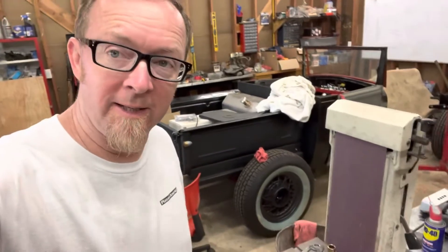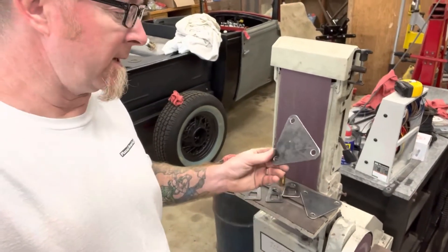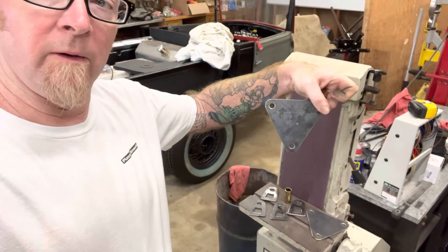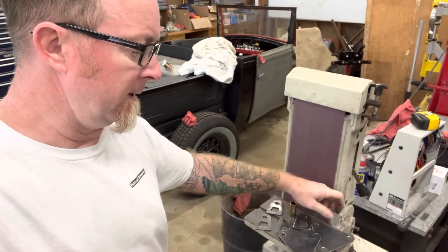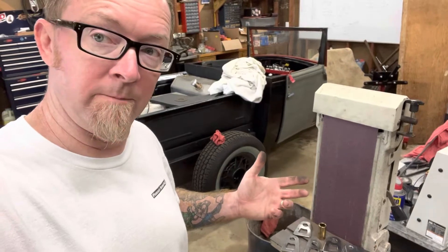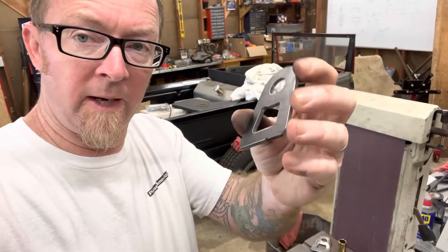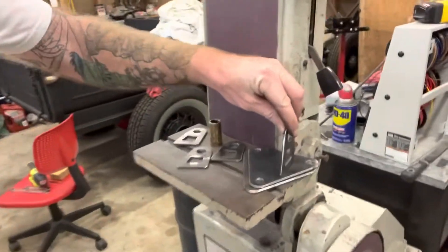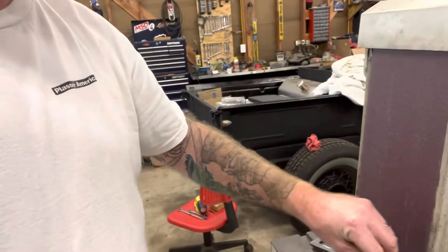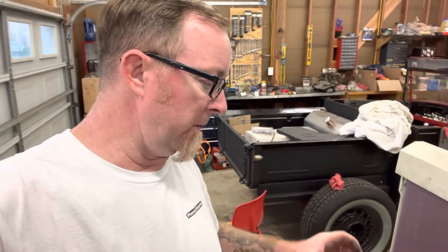So tonight I'm finishing up a little bit of work on some engine mounts. I pulled all the dimensions off a drawing I found online and they were spot on — for a small block Chevy, nothing fancy. These are the brackets I made originally to hang off the frame, but I'm going to land them on the engine plates instead. I'll probably go with some quarter-inch plate at the block side and build these up in 11 gauge.